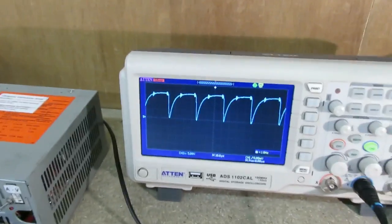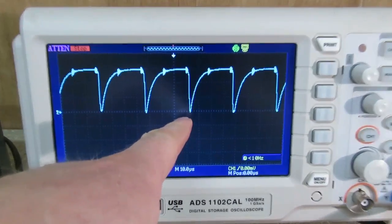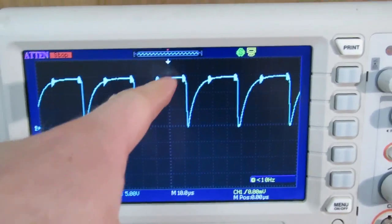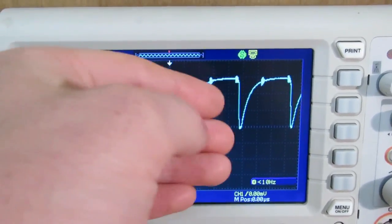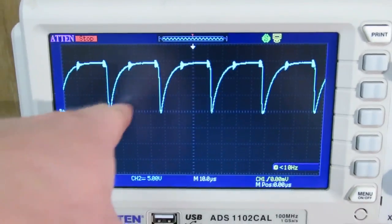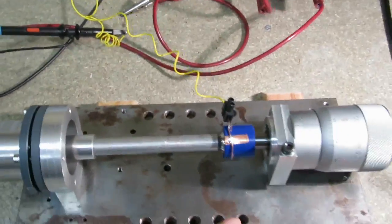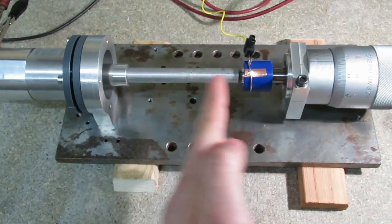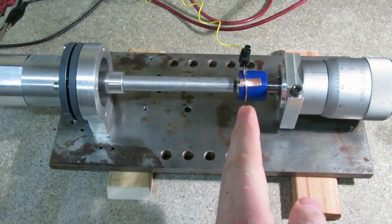Turn the horn off just now. These drops from 15 volts down to zero occur when the vibrating horn tip comes into contact with the ball, and this obviously occurs once every cycle. So at that position the horn tip is vibrating and the ball is just touching the horn at the peak of its vibration.